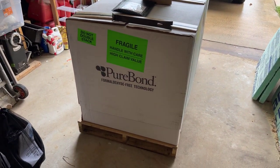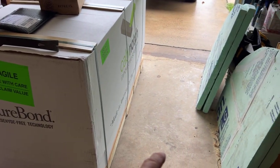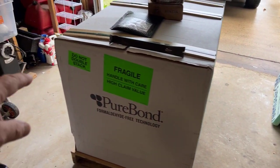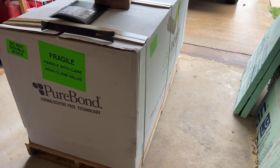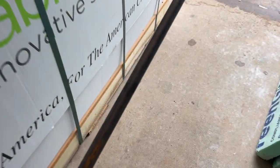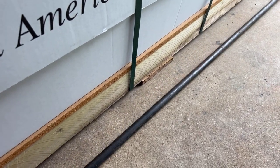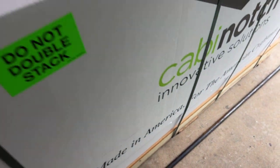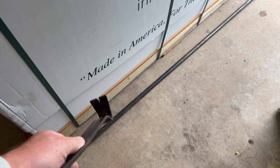What I've got is this big pallet here — 465 pounds — and I need to move it over in this area here so that I can put my other parts over here. A very easy way to do that: I have a pole here, which is a black pipe pole, and I'm going to lay it down so that I can roll my pallet on it. I also have a nail puller pry bar, and I'm going to use that to lift the pallet up.